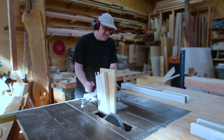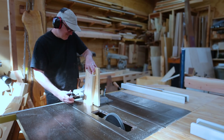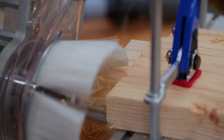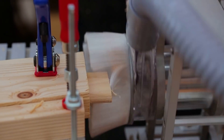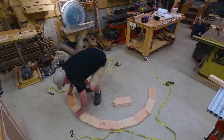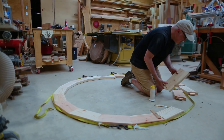I did a couple of tenons and wondered if it would help to remove a little bit of material first. So I set up my dado on the table saw and cut a rabbet on each side of the segment. Then routing out the tenon wouldn't mean removing quite as much material — it definitely helped, though whether it's really worth the extra time is questionable. This got me thinking that the joint between segments could be done entirely with a dado set, making two rabbets on one end and a dado on the other end of each segment.